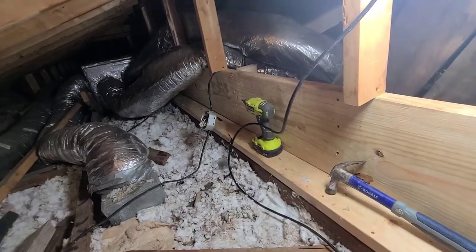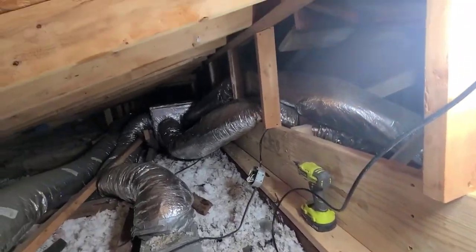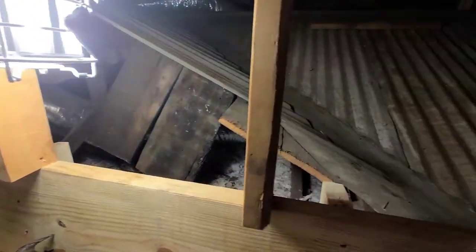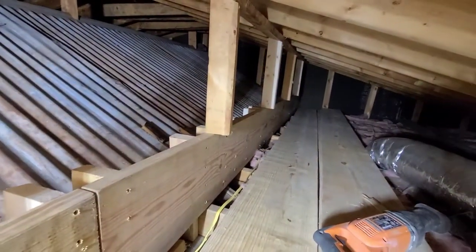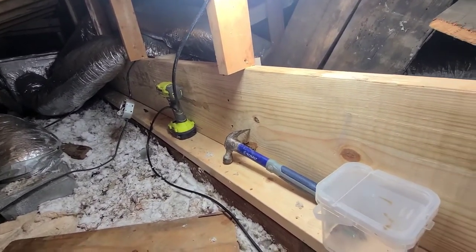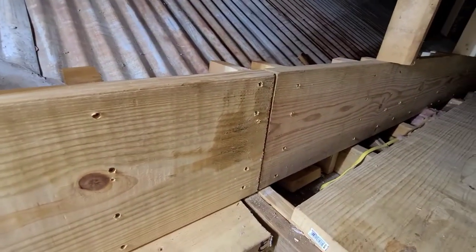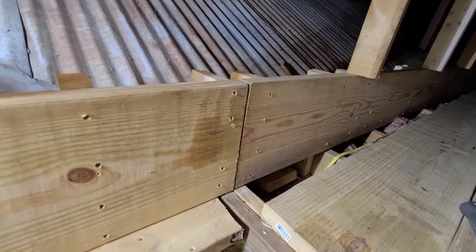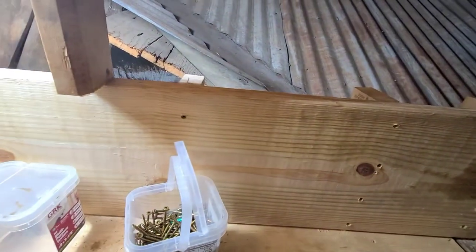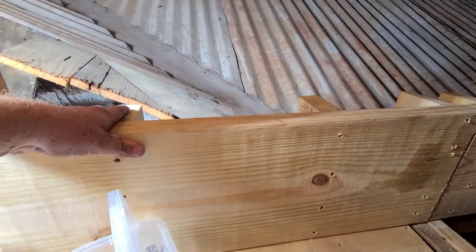Hard work's done — well, half of the hard work. This first beam was pretty hard. You've got to go ahead and mount all the supports behind, which is time consuming. I got all the knees cut to support the ceiling and all back installed on top of this beam. The next row will be super easy because all we're doing is cutting one of the 2x12s in half, putting each half on the ends and a full 12-foot piece in the middle. That way we have good support of this joint right here.